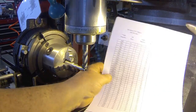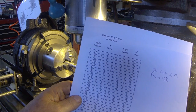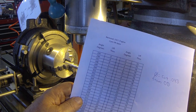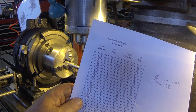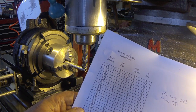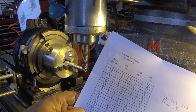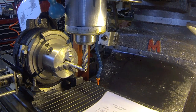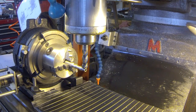What I've got here — I don't know if you can see it — it's a chart. It starts at 295 degrees and increments up, and it tells how far I need to lift the cutter or drop the table. The first three increments I just go straight across. I've got it zeroed down here on the flat, and that's zero position. So here we go, we're ready to go.